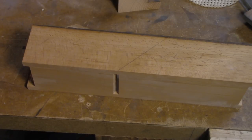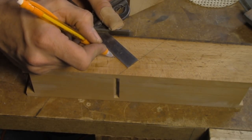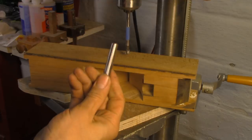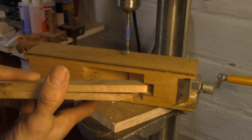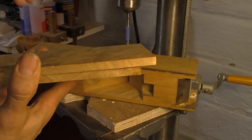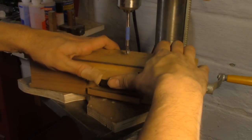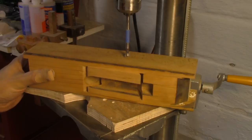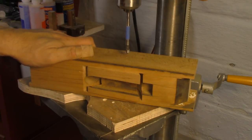Now I'm going to lay out and drill the pin location. To place the pin, I'm going to go up 1⅛ inches from the sole of the plane and ⅞ of an inch from the ramp. The best way to drill this hole is with a drill press using a Forstner or brad point bit sized exactly to fit your cross pin. But if you don't have a drill press, you can lay the two cheeks of your plane on top of one another and drill through with a hand drill — that'll get the holes to line up close enough. Before drilling, grab the off-cut from when you cut out the two angles and stuff that in, and make sure your plane is sitting on a backer board. Both of those things will keep the holes from blowing out while drilling.